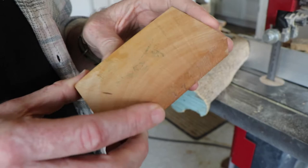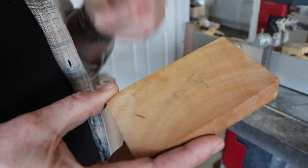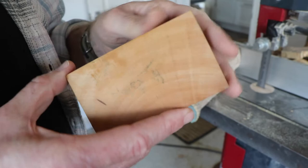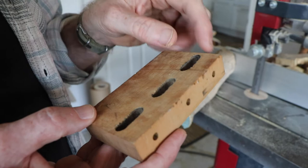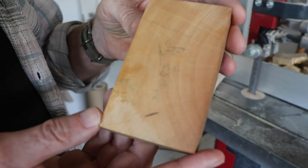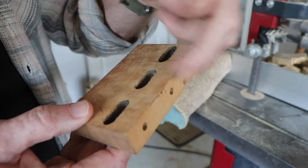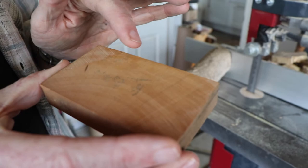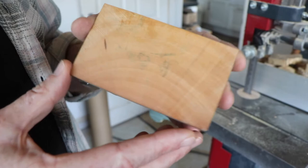This is a section from a very old engraving block that I'm reprocessing. It would have had some kind of trade engraving on the surface, which I've milled off and taken apart. Interestingly, this is an example of a composite block joined together with brass bolts, so that a large block could be taken apart and a section given to each engraver in the workshop. They would engrave their section, and when everyone had finished, the block would be rejoined with the bolts. The master engraver would then very carefully engrave the seams so it looked like one complete and continuous wood engraving — an extraordinary level of skill.